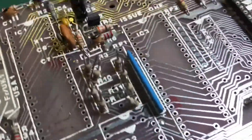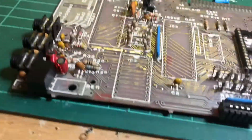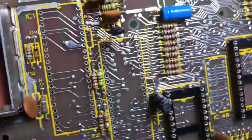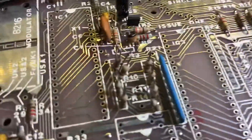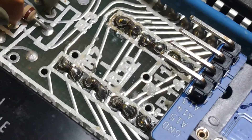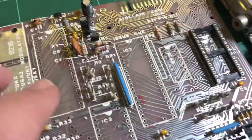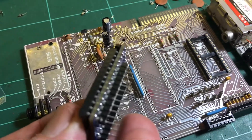Before I do that I need to get rid of these horrible resistors. There are different types depending on the board issue — this is an issue 3, and you can see the resistors are all horizontal, whereas on an issue 1 they're vertical. Here's one I've already done: I've replaced the resistors with surface mount ones, which then allows me to fit the ROM converter board on top.